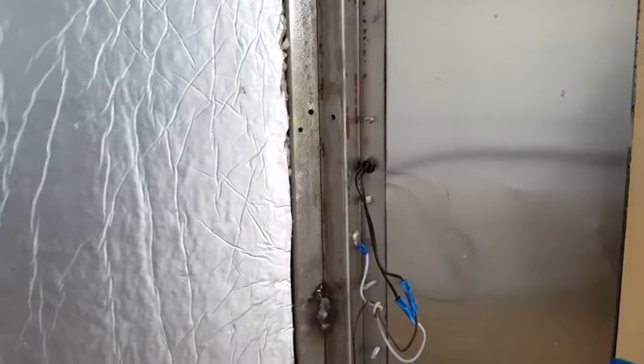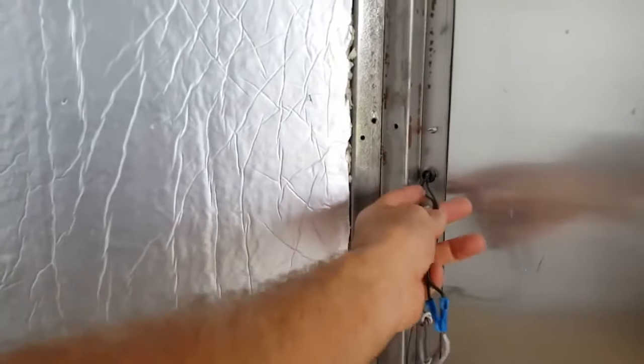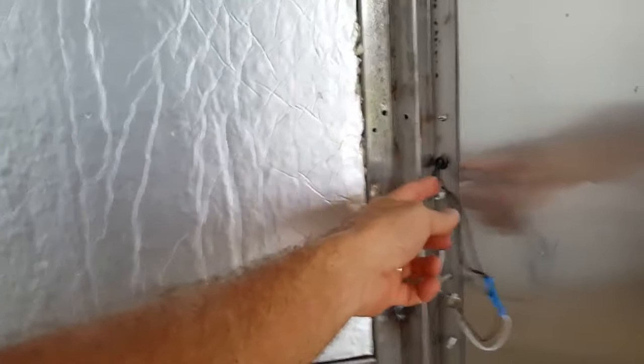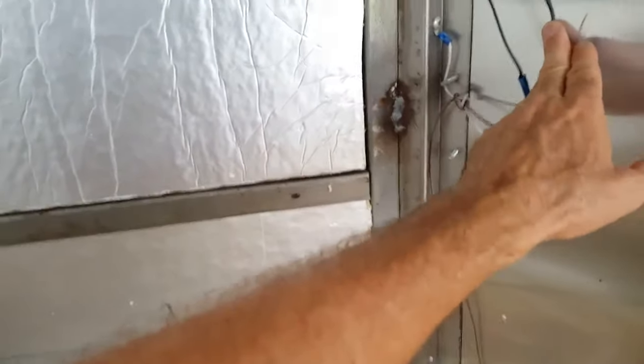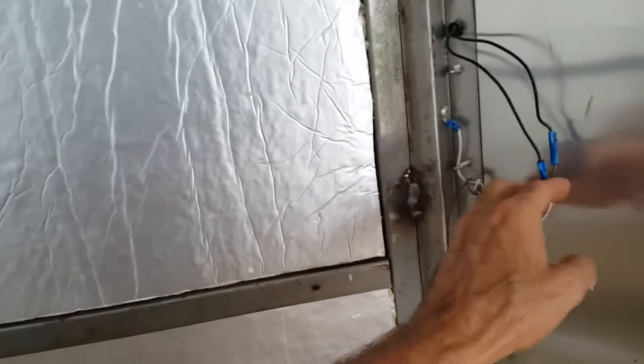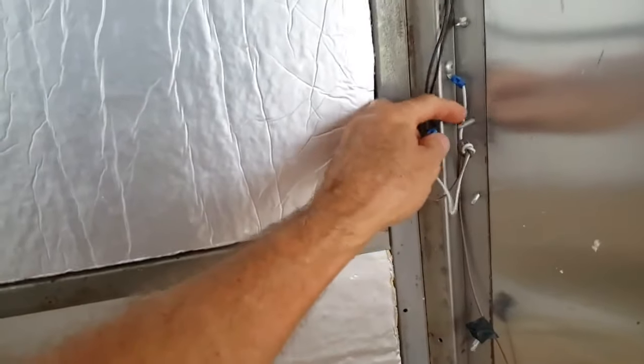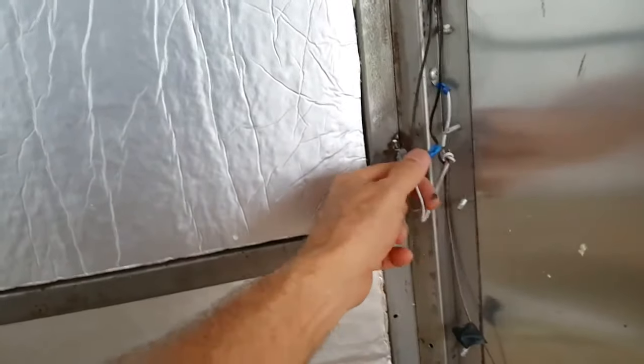The first thing to consider when building your trailer is making sure it's insulated — walls, roof, and optionally the floor. While installing insulation and walls, also consider where you'll run wires for electricity: where the lights and outlets will go, and what wires go inside versus outside the walls. Wires inside the walls look cleaner but are harder to work on if something malfunctions, and easier to pinch, cut, or short. Running wires along the baseboard or outside the wall makes them easy to access and repair.